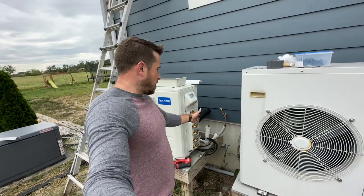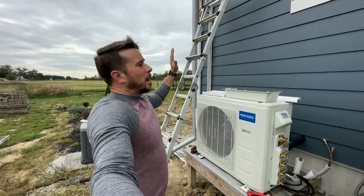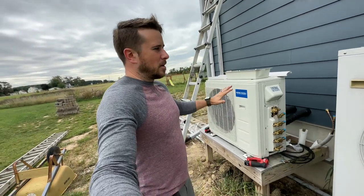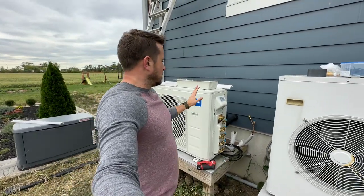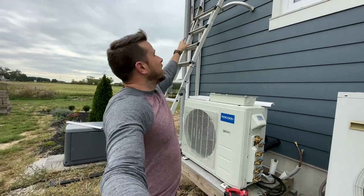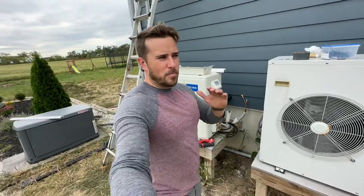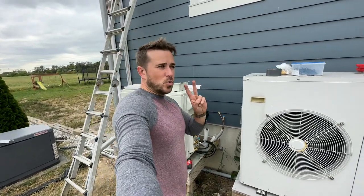It's pretty windy out here, so hopefully my dead cat will keep that from sounding terrible. I'm at the point now where I think I'm ready to hook up my line sets to the outdoor unit. I was just standing here trying to think of everything I might possibly be missing, because I don't want to hook these up and then find something I really wish wasn't connected. I've got all this stuff uncovered still because once I get everything connected and the unit is up and running, I need to leak check all of these connection points. I do have a special situation — I have three indoor units connecting to this one outdoor unit, but I only have two ready to go right now.